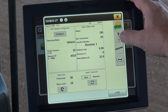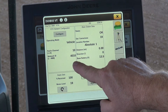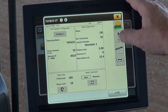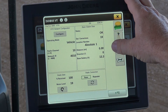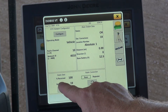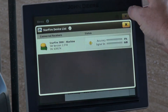Now we have our base station information: you have your radio channel, your network ID information, status is OK, satellite correction numbers, distance to base — you want to be no more than 10 to 12 miles from your RTK base — your base battery information, and your radio data percent received at 100%.